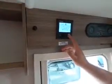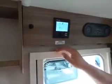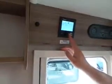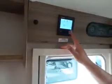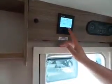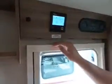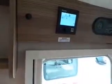Put it back onto eco. Next one across is your power select. Your heating system and hot water will run on gas, electric, or gas and electric. To select the mode: it's either gas mixed one, which is electric and gas, or mixed two — again gas and electric — and then electric one and electric two.